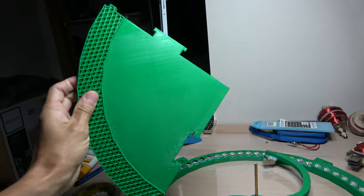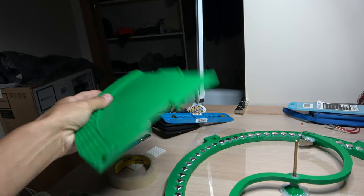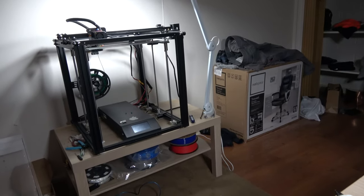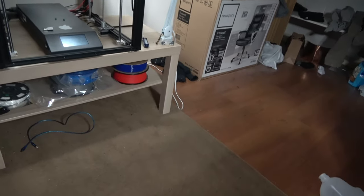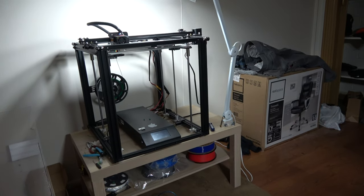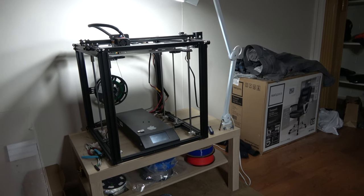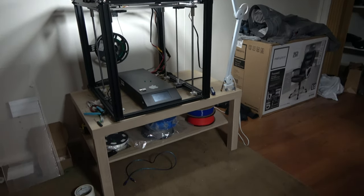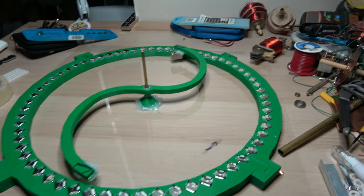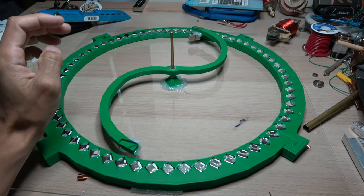You can see how the pieces slide in. This was an earlier attempt that was also aborted because the piece popped off the bed. The printer has a feature where the bed stops heating after about half an hour, so I had to override that feature. There were a lot of bugs to work out with that printer, but I worked them all out eventually.